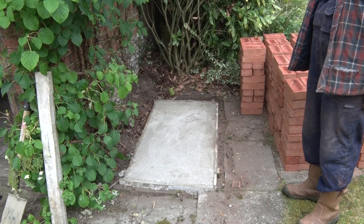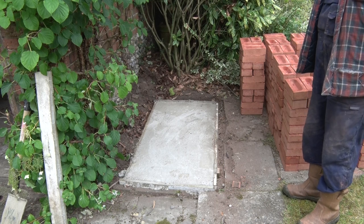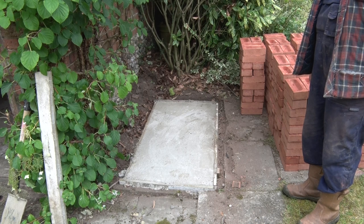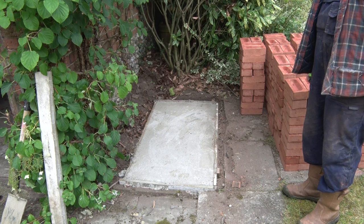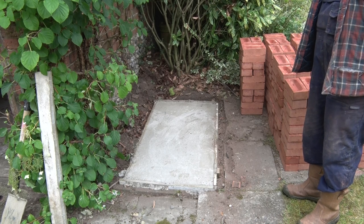A couple of days ago I poured myself a concrete base. It's a fairly decent size as you can see and it's about 120-130mm thick, made out of a combination of ballast and cement. So that should be fairly solid and give us a good solid base to work with.